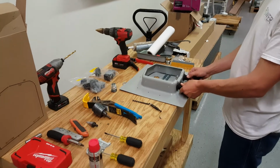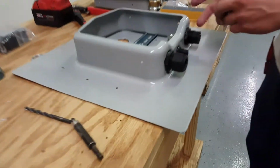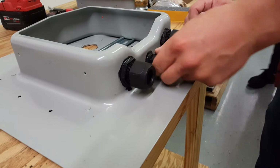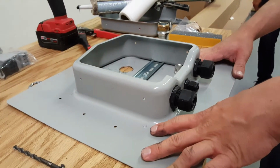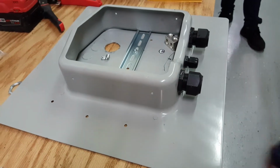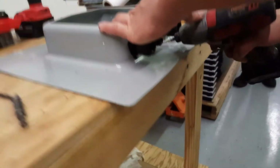Drilled out, everything's sealed up inside here. You want to go ahead and put the ends of the connectors back on. Depending on your location of the SOLADECK, you may want to put weep holes in case this builds up with moisture. In order to put a weep hole in, you'll grab a small drill bit. You just want them low. So I drilled 2 here.